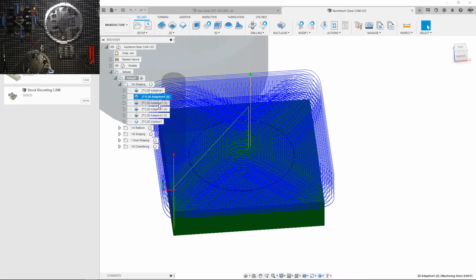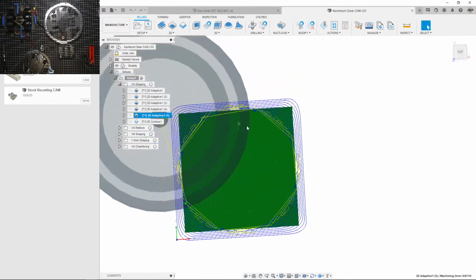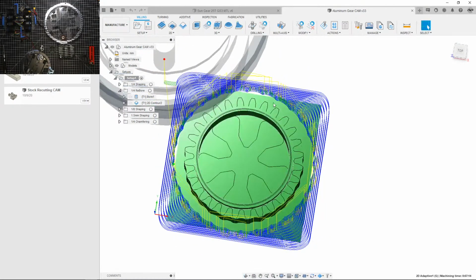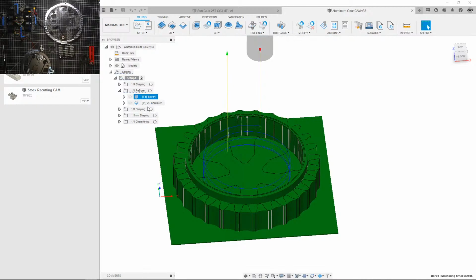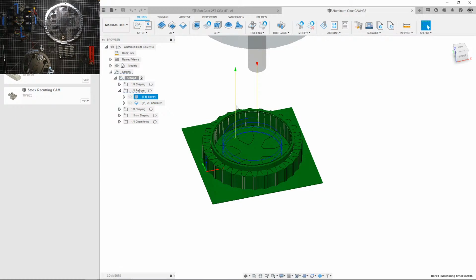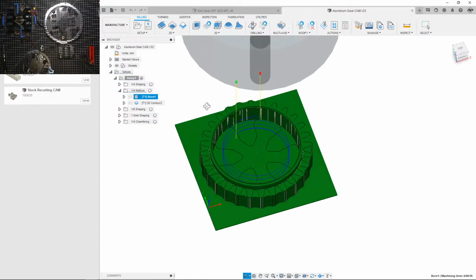Okay, so I took a whole bunch of material. I'm going to try avoiding that. It did leave a nice outline of the shape of the gear, so I'll keep doing stuff with that. I think I'll stick with an 1/8 inch end mill for the outer part here, because I don't think I have that much space, since I need to cut out 2 of these gears. Cramming them into a stock that can barely fit them is going to be tight. So an 1/8 inch is just barely going to pass.